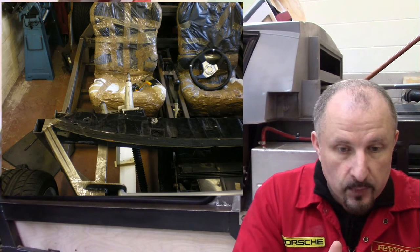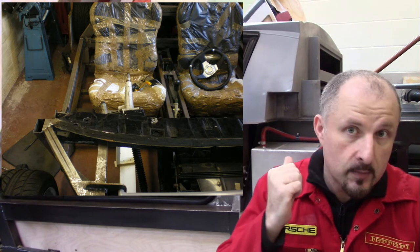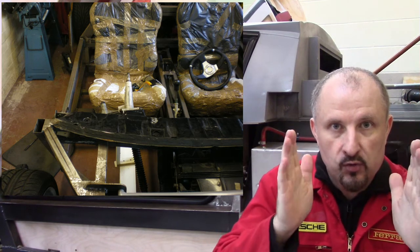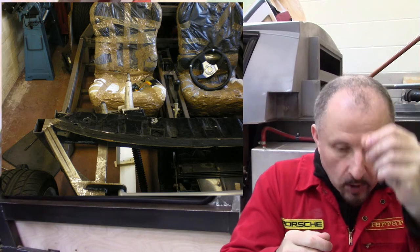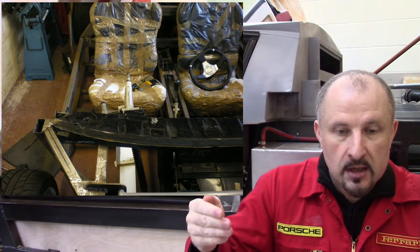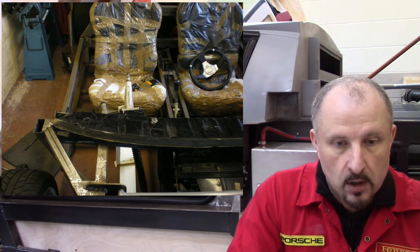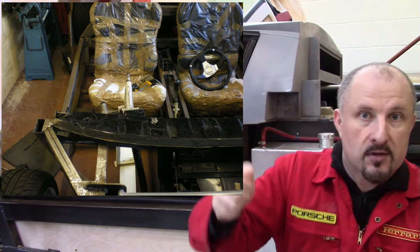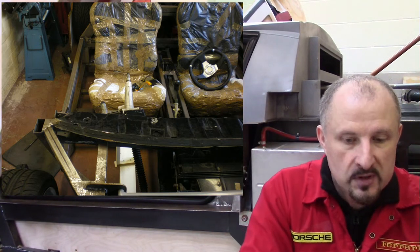There's another close-up of the steering column. What I was trying to do here — and I did manage to do it — is I got the seat completely central to the steering column. I put a string, a plumb bob, so it went down, measured out, and centred the seat. That's how I got the seat to be absolutely spot-on. I absolutely don't like steering positions where the steering wheel is off-centre — really annoying — so I wanted an absolutely perfect driving position.